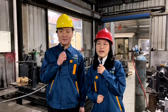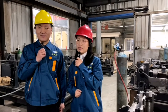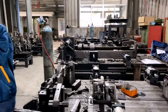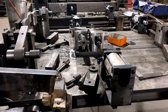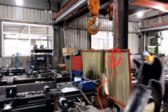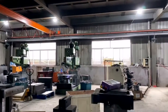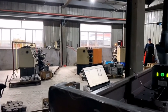Now we see the tooling and fixtures for the chassis. A good tooling ensures the consistency of the chassis quality. This new fixture uses electrical control — we input the same data for each model, so every chassis will have the same dimensions. It is more accurate and precise than the manual control type, so the new one ensures consistent and stable quality.